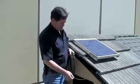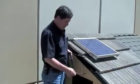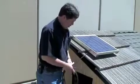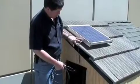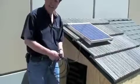In this demonstration I'm going to show you how to bring the wire into the side of the building. A lot of people make the mistake of bringing the wire directly into the building like this, and what can happen is the water can track the cable and come in, causing damage to the ceiling inside.